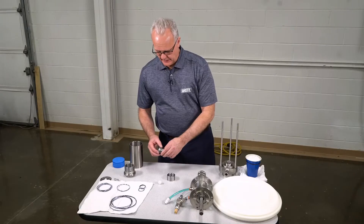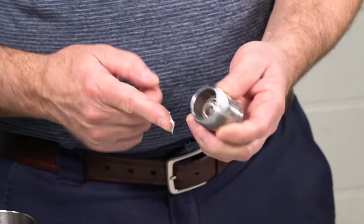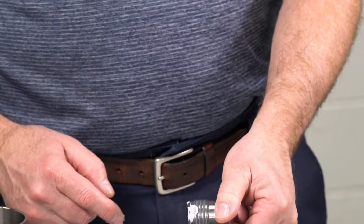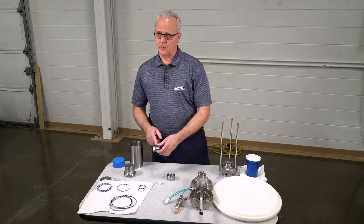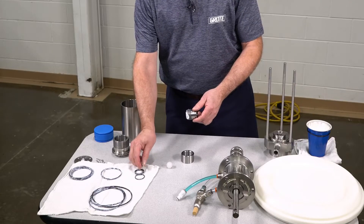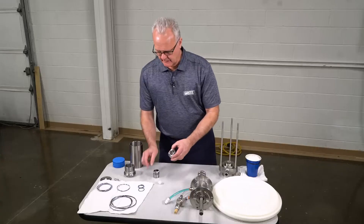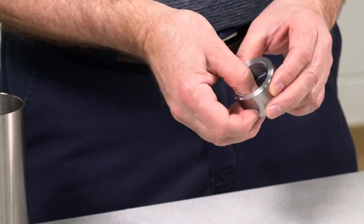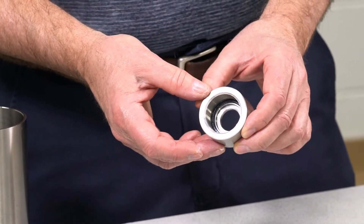The next thing we're going to do is grease these threads. I want to put a couple of dabs of grease on the threads at the beginning so when it threads on it coats the threads from one side to the other. This first groove here is where one of the o-rings seats so I need to make sure I have grease on that also. The first o-ring is one of the small ones. It is placed down inside — there's a flat area that it seats in and I'm going to make sure it's seated down in there.